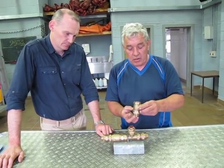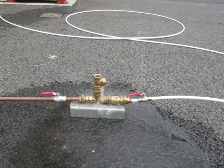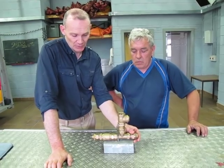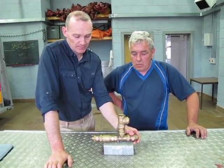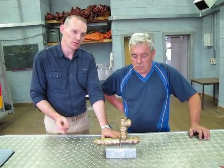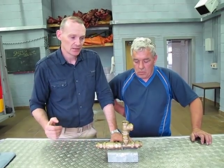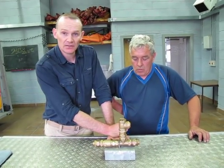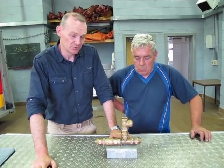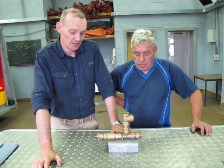Under constant working conditions these flap valves will last up to 12 months. Going back to the feed pipe, you should put in a rigid pipe for a couple of meters in advance of the pump. This is to deal with the problems you have with a flexible pipe — water hammer will go back up the pipe and if it's flexible you'll lose some of the force and efficiency of the pump. Using a rigid pipe for a couple of meters beforehand is advisable; it's not absolutely necessary but it does help.